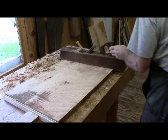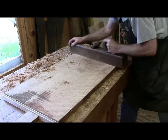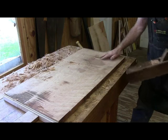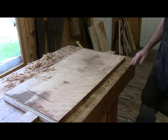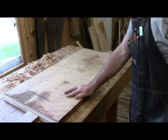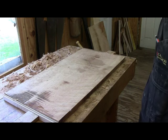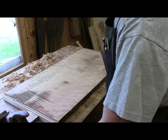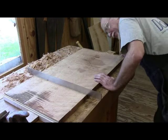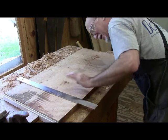Getting my workout for today — flattening one half of the top here. I'm taking the cup out of it. This will be cut off on this side so we don't have to get it too flat there. And I can check it — I've got a straight edge and it looks pretty good right there.